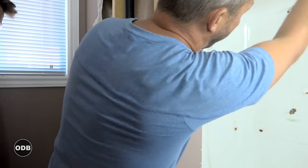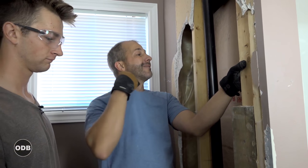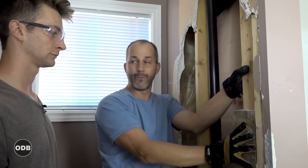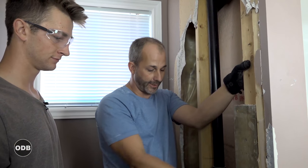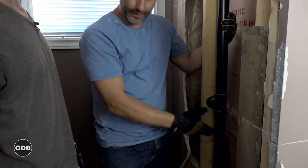There's a flange that's going up and around — it's all covered up in drywall and painted in. The only way to get this shower insert out of here is to get rid of the framework that surrounds it, so we'll finish cutting through. Don't cut the vent.